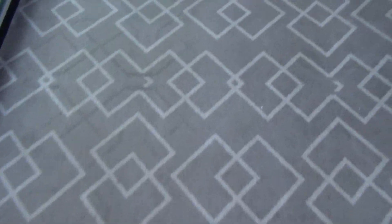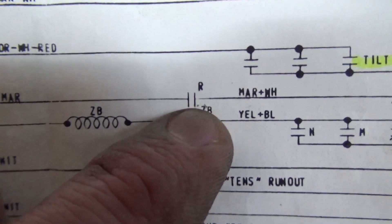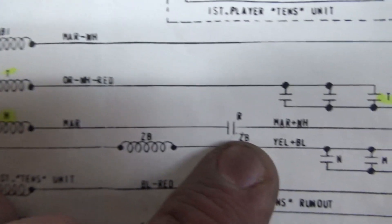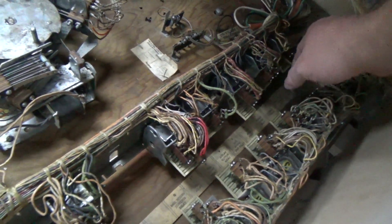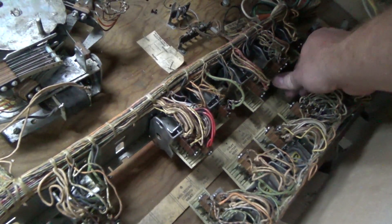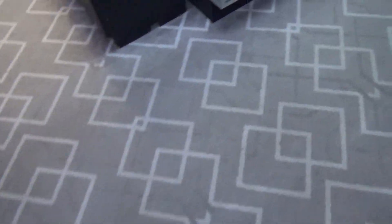I'm going to show you that little part of it and then you can leave your comments down below on what you think the problem is. The H relay is not pulling in — the R relay is the hold relay and it has to be pulled in, or that relay will never come on. So is the R relay pulled in? The R relay is the other one that they replaced — and it is not held in. Well, that's our problem. The R relay is not holding in — no wonder the H relay isn't holding in.